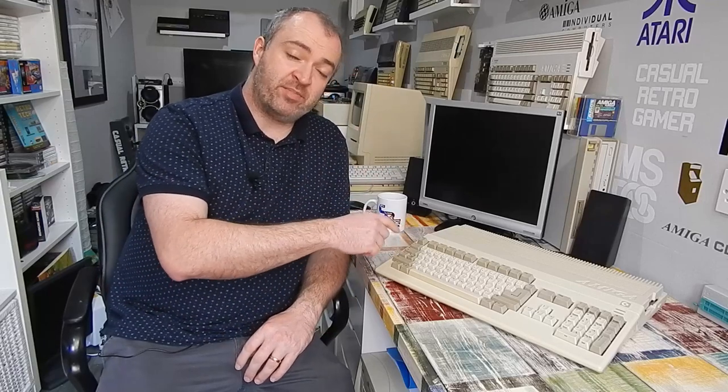One question that comes up time and time again is how do I connect my classic Amiga computer to a modern display? Well, the best video signal you are going to get out of this thing comes via its RGB video port. That modern display though, well, it's going to be looking for HDMI, so we need to convert between them. To date, what most people do is use an RGB SCART cable, then a SCART to HDMI converter.